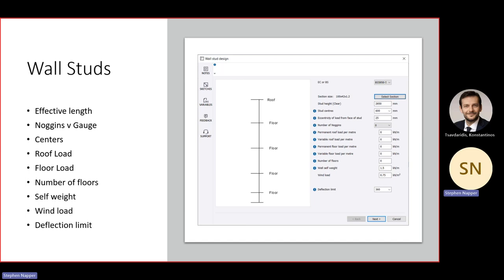It's better to get accurate wind speed information for the specific site location, especially for light gauge steel where it can be a critical design factor. For deflection limits, we default to span/360 so we don't crack the plasterboard. You might go to span/250 for more flexible finishes, or up to span/500 for really brittle finishes with a masonry skin. It's arguable you can apply span/500 but halve the wind load because both skins take half the load each, acting as a sort of lattice truss via the wall ties.